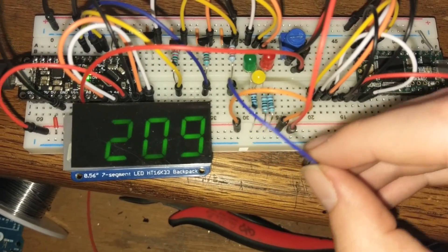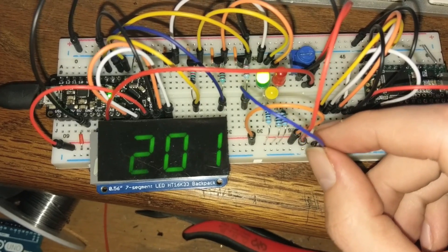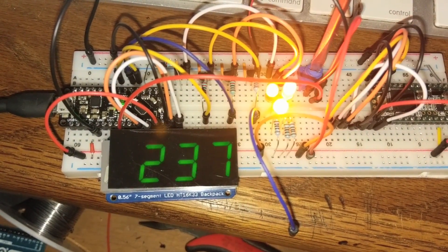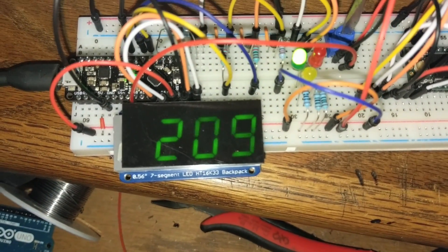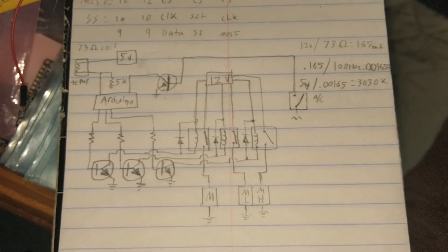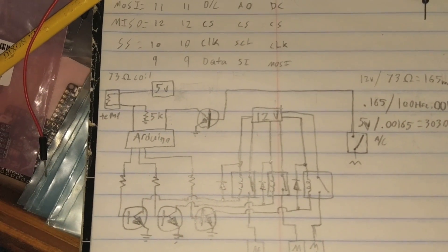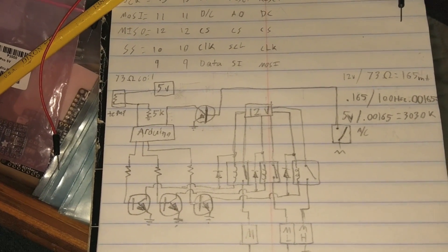The fourth transistor is interesting. If we take our AC line, the low fan comes on. I should put a timer on that so it takes like 20 seconds after losing a signal for the fan to shut off, in case the AC flickers. The cool thing is that doesn't affect the other bits - for instance, if our AC goes high and at the same time our temperature starts to go up, the other ones still work. The temperature has a 5-volt line going in, and it comes out to the Arduino with a 5K resistor to ground in the middle so we can get the signal we need.